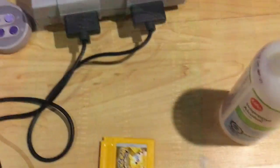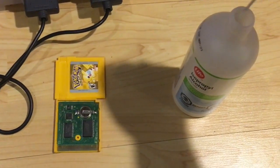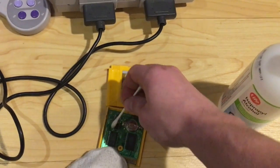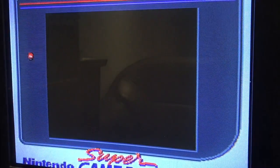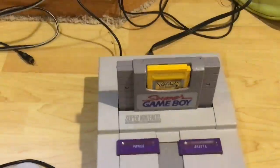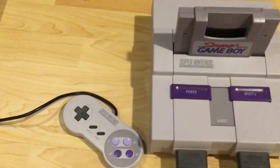While waiting for the soldering iron to heat up, I discovered something. Remember how it was a white screen? I've done this many times — it was not just a bad connection. I took a little isopropyl alcohol and wiped down the pins on these chips, gave it a little dry, slid the cover on, popped it in, and it's working — it's recognizing the game. But once the pins dry, I lose picture and lose the game. That tells me there's something wrong with the soldering on these chips.